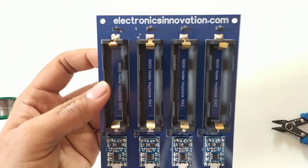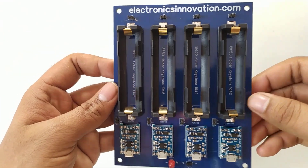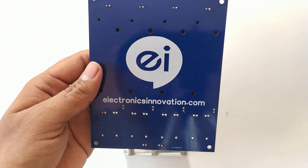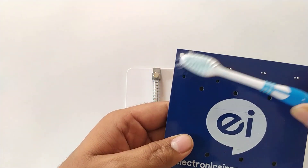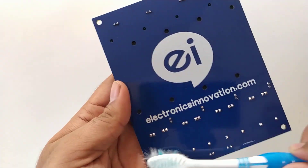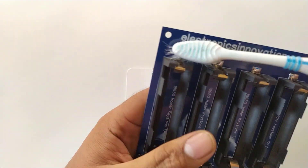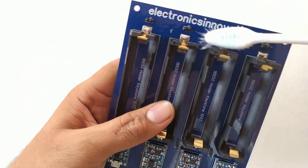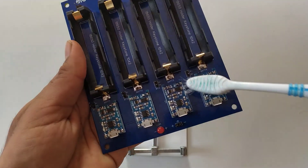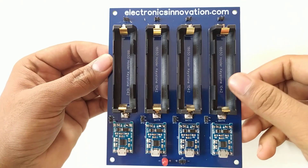That's it — the assembling process is completed successfully. After all components are assembled, the PCB will look like this. We have to clean the PCB with IPA, which stands for isopropyl alcohol, using a brush to remove the soldering residues. This is the best practice that every standard PCB manufacturer suggests. After cleaning, the PCB is looking like a diamond — ha, just kidding, don't mind it.